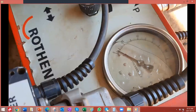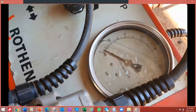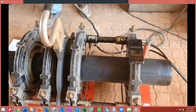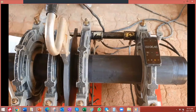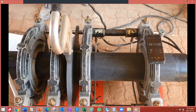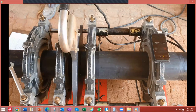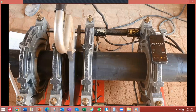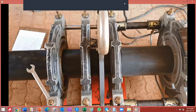During the bead forming, the heating time is that the hydraulic unit is set on 2.2 bar. The next phase will be the changeover when we remove the heating element. We then have 10 seconds to bring the two pipes together and we have to ensure that it is a gentle touch. We then have a further 11 seconds to bring it up to full pressure.